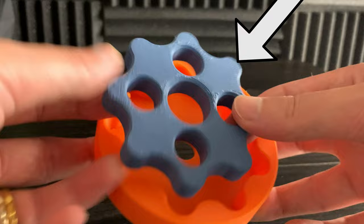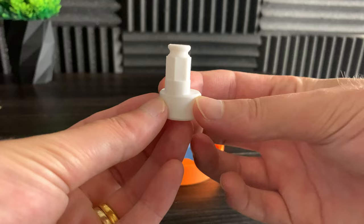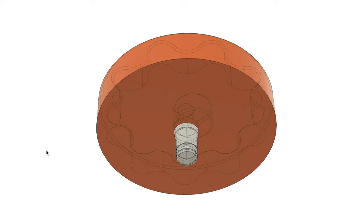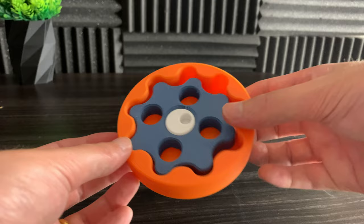Because it's smaller and has one less tooth, you can see how it can kind of rotate inside of the other piece. The next piece is critical to making the entire mechanism work. This is the eccentric pin. The pin portion is centered in the entire mechanism, and you can see the addition of a larger eccentric circle. This pin is basically the input axle, and you can see how it helps align the center cycloidal gear.